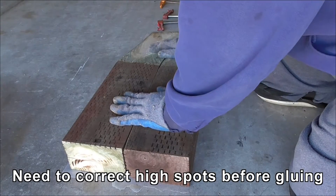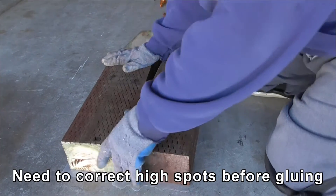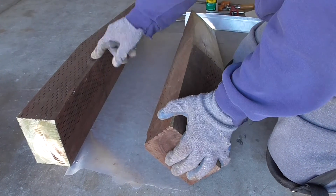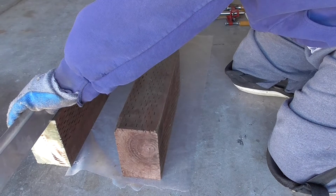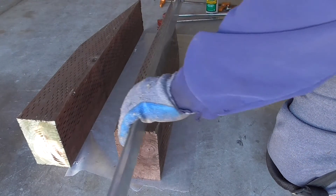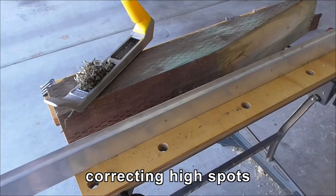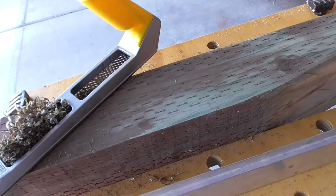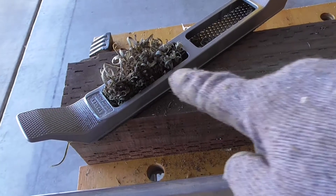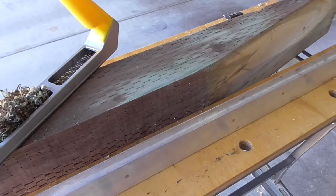I need to see how much of a gap I've got and how much needs to go. The other two ramps look together fairly nicely, but this one has a lump somewhere. I'm going to use my straight edge to find out where — it could be right where that knot is. Rocking the straight edge over it, there seem to be a couple of high spots: one here, one in this area. It didn't take much shaving to get them off — probably 30 seconds in each spot.